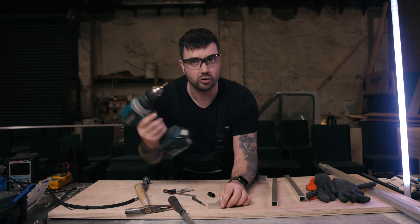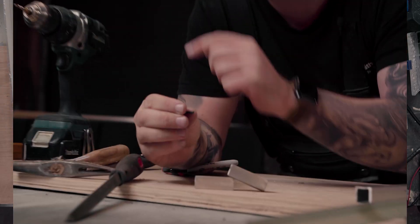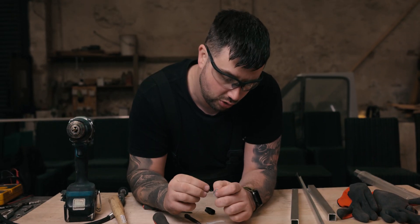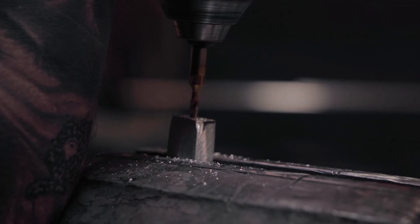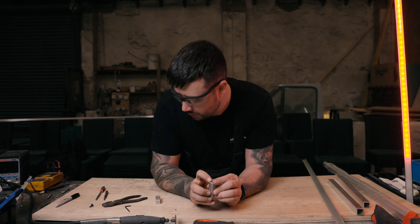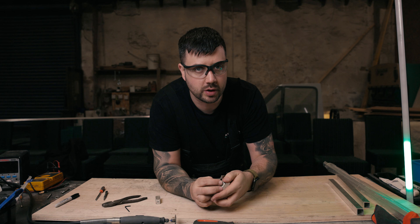This is what's called a drill tap. The bolts I have here are M4 bolts — more precisely called machine screws. All I'm gonna do is run this drill tap into the aluminium, which will create a thread inside it, so that when I screw this in, it'll hold it all together. Now that these holes are drilled and tapped on an M4 thread, I'll assemble them, bolt them on, and show you once it's finished.